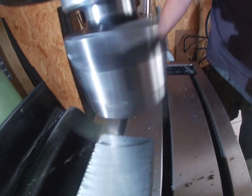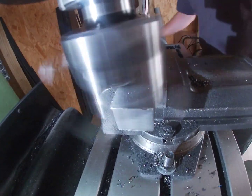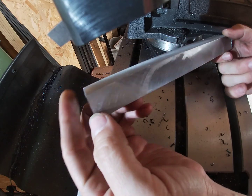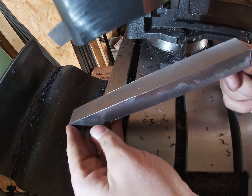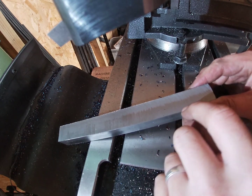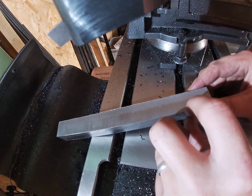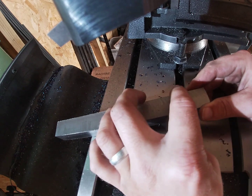I've got the material set up in a machine vise and I'm just using a fly cutter at a thousand revs. So we've got our stock down to the overall dimensions now — that was just using a fly cutter at a thousand RPM. Now we'll start looking at cutting in the shoulders down this side and down the far side. At the moment the total width matches the wide point of the t-slot at the bottom, so we'll get set up using an end mill rather than a fly cutter to cut in those shoulders.